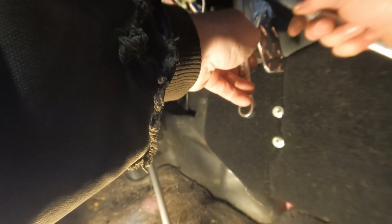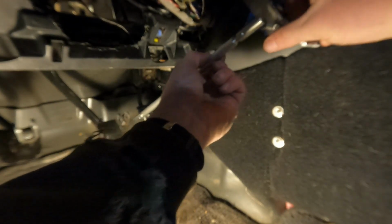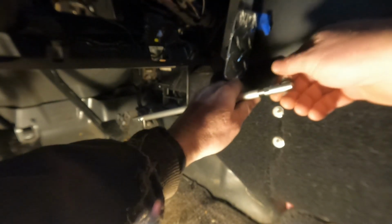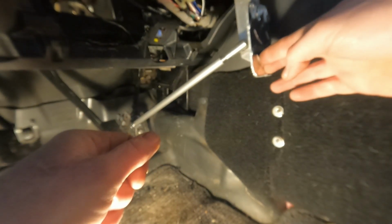Don't want it to squeeze. And then this rod just goes into the side of that pedal. And you can see the motion, fairly similar to the stock gas pedal. It's kind of straight up and down. I'm gonna adjust this up just a little bit. Reverse threads on these. That looks good. I like that. This pedal is parallel with the stock pedal. It travels in pretty much the same arc, same plane. I think that'll be good there.